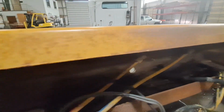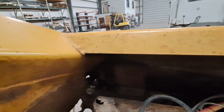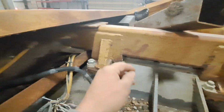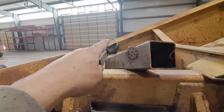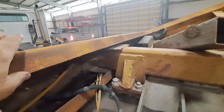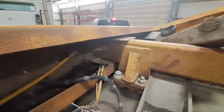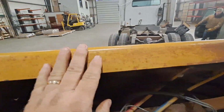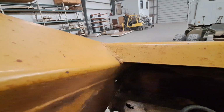So I told Brent, what a guy needs to do is break paradigms, which I seem to be good at. Crack there. And get the load and the horsepower, which is this, to the main structure of the side there. So we need these tied together. We don't much care what was here, which the top is all solid. Bottom's rusty. So I'm thinking we'll tie them together with maybe a piece of heavy tubing clear across the top. Tie into this, and tie into these sides. And then we're gonna obviously have to patch these spots.